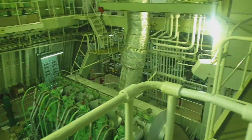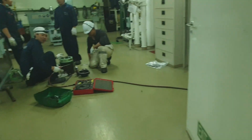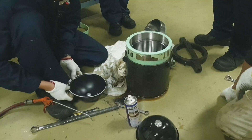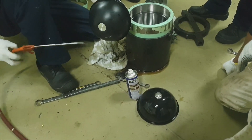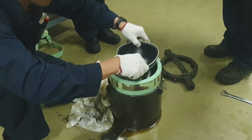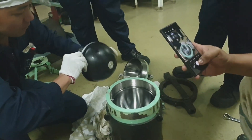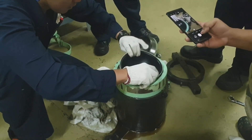That's where we remove the accumulator assembly — from the hydraulic power supply unit on the accumulator side. This is our engine room workshop where we overhauled the accumulator assembly. That's how the backup ring of the accumulator membrane looks. According to the instruction book, this side has to be cleaned properly, and lubrication must be applied to the thread part or lock part of the accumulator assembly.